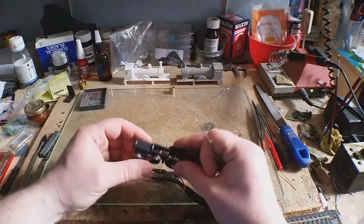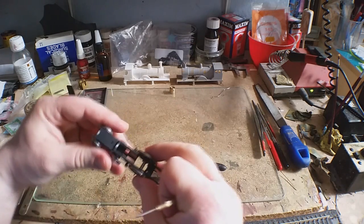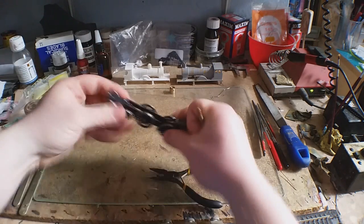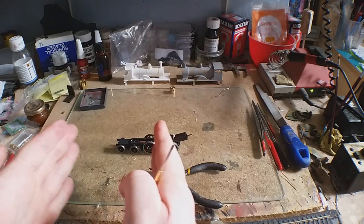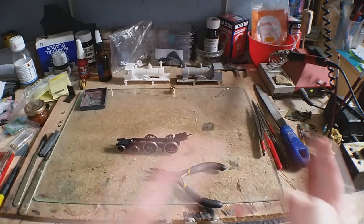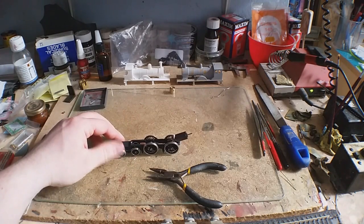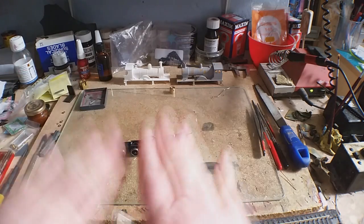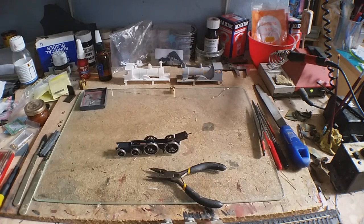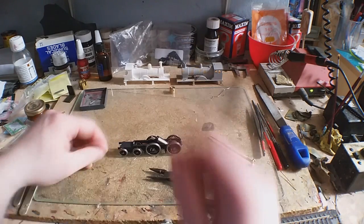The other thing is, the actual pivot arm, again, you don't have to build this with a pivot arm, but I am doing on this one. But the wires are going to go either side of the pivot arm. So as it moves left, the wires are going to be pushing against the pivot arm, so you're going to have some centering, okay, which real things had. So yeah, basically, springing downward, springing sideways to level it, and electrical continuity. That is the experiment I want to try, the 3-in-1. Will it work? Let's find out.